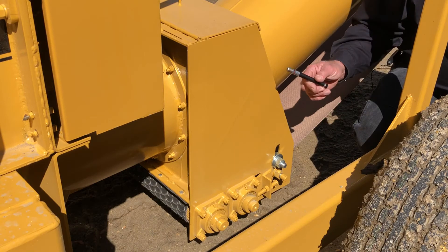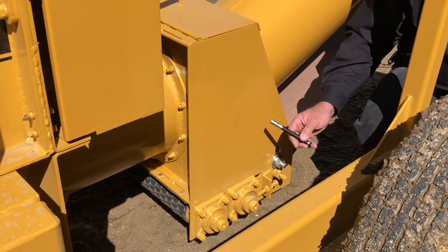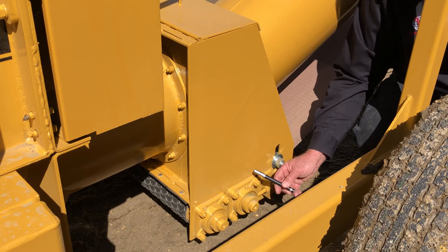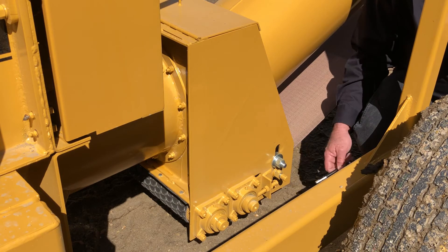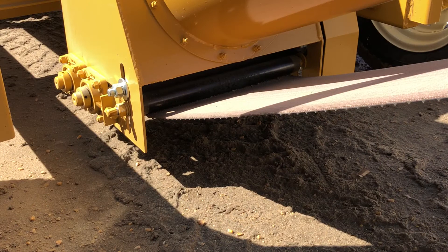This particular roller mill is equipped with one of our 18-foot discharge belts. The belt comes around the drive roller, up in between two rollers where it's pinched, and back down under a third roller that's used as a tracking roller. This is what actually drives the belt for the discharge. The third roller at the bottom of the belt discharge is our tracking roller, and is also used in taking up the initial bulk slack of the belt.